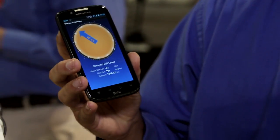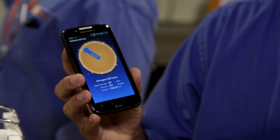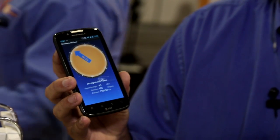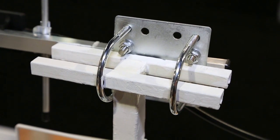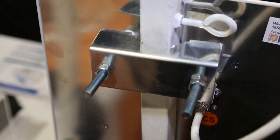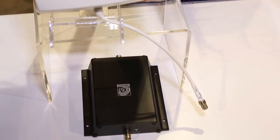As you can see here, we have the direction of where the signal is coming from. We would simply need to mount and aim our antenna in that direction to get the maximum benefit of the ZBoost booster indoors where we have our internal distribution antenna. As a general rule of thumb, these should be installed with at least 15 feet of vertical separation from the internal distribution antenna.